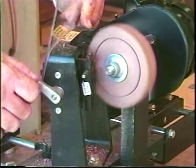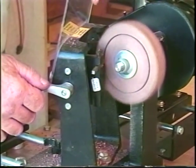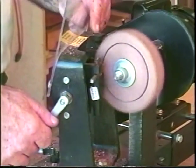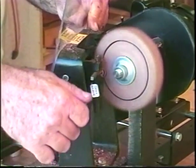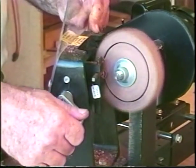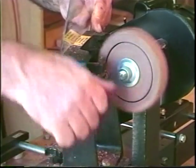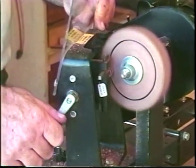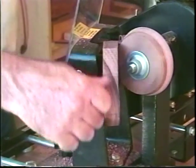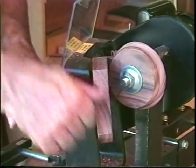You want to make sure that stays free or else you're going to get burn marks in your stock. As I finish the one cut and come through on the other side, the left blade automatically will back out. It's binding a little bit so just back it out and knock off your excess pieces. The piece falls off harmlessly — you've got a completed cut.